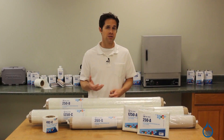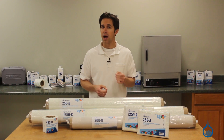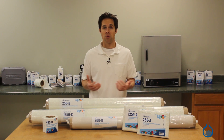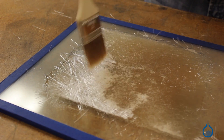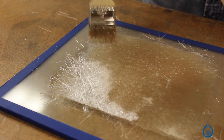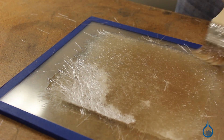These random fibers are held together with a light binder that should not be used with an epoxy resin system. Mat is compatible with polyester and vinyl ester resins and should always be used with a resin to make hard laminate parts. In fact, it's often used along with fiberglass fabrics as part of a lamination.